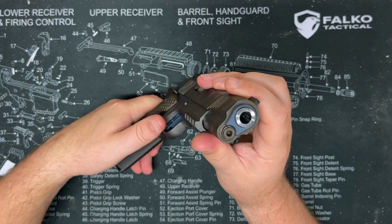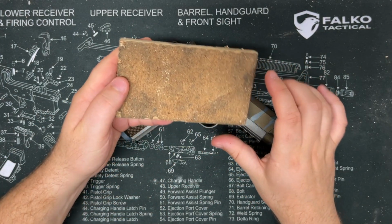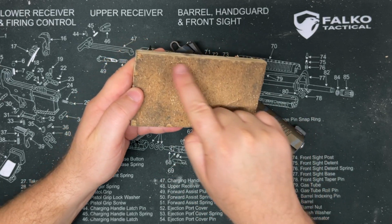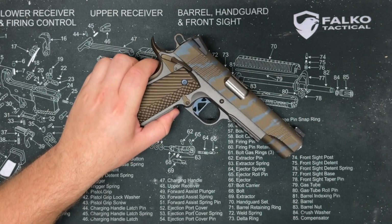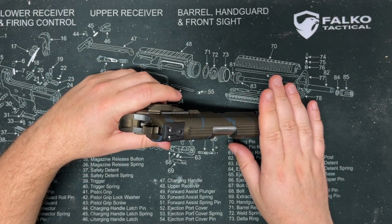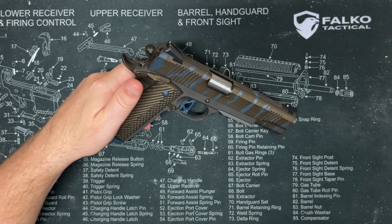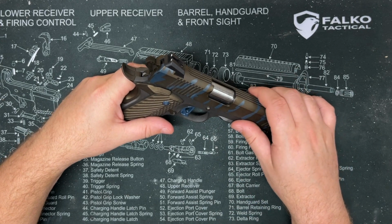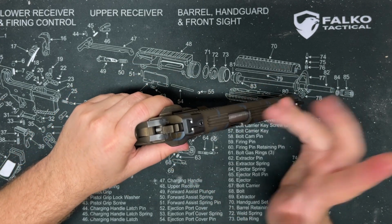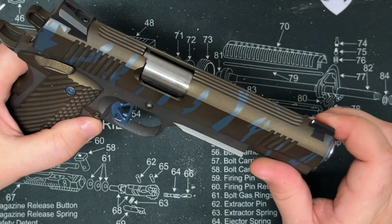You can also see that in a couple little areas around the edges here. You'll remember I was pushing with this, and you can actually see the darkness where the lapping compound's been embedded in the cork, which also has some abrasion to it. I was a little rougher on this through the process than if I had fit it better before lapping. And again, that was a problem because now I'm wearing my brand new Cerakote finish. It is not impervious to wear.